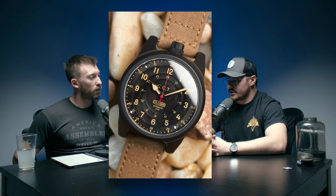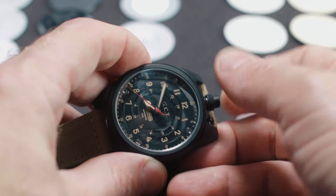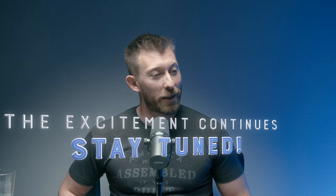The one issue with the GCT dial is on the machined variant — the shiny option — where it's not sandblasted before it gets DLC coated. They're having issues getting the coating to adhere to the really smooth surface. The first sample we sent early on looked great, but now we're having trouble with that. I just sent off another batch of dials for more testing, so we'll have more definitive results soon — that will be cliffhanger number one.